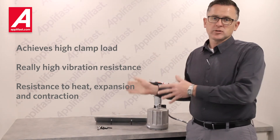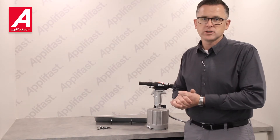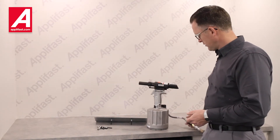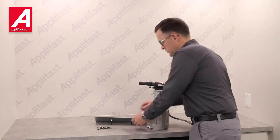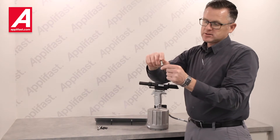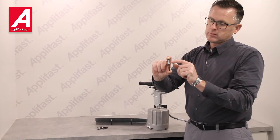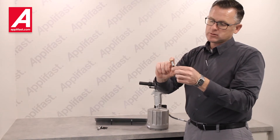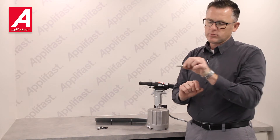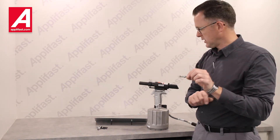We'll demonstrate that in these materials and try to give you a close-up so you can see what's going on. The 256 tool is pneumatic hydraulic and connects to an air supply hose. The Huck fastener has a grade 8 center pin, and the outside is a sleeve with the same diameter as the mandrel. We put that through the hole and then swage the collar on the head side.